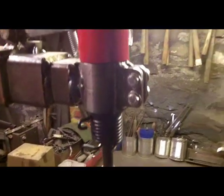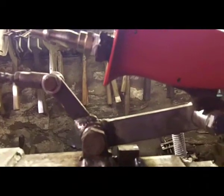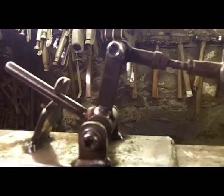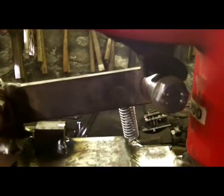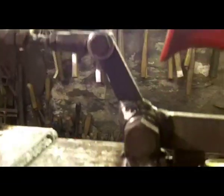Right, I just wanted to show you - this is the first side done, this is the planishing hammer done. I don't want a foot trigger on this to start it, and I've just made up a wee linkage device here which is just spring loaded - you can see it in there - and basically operates the trigger on and off. It's fairly straightforward, just my swivel device, very much like a gear linkage in a motorbike, and just allows me to operate it with one hand.